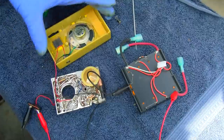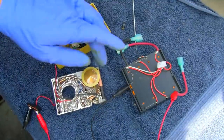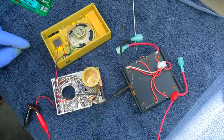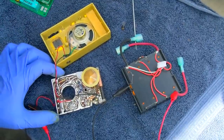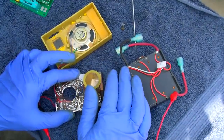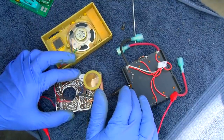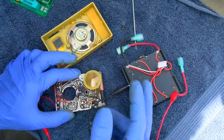I just took the bad transistor out. So now it's going to sound sort of distorted and single-sided, but it got rid of our light bulb current draw and obviously it's loud and clear. Except the tuning capacitor is corroded inside — from the moisture. I don't know where this thing was stored, but obviously it was in a damp environment. How do I feel about spraying contact cleaner in it? I really don't feel good about that on one of these with those plastic-covered wafers.